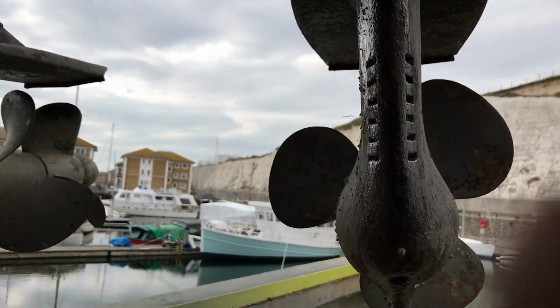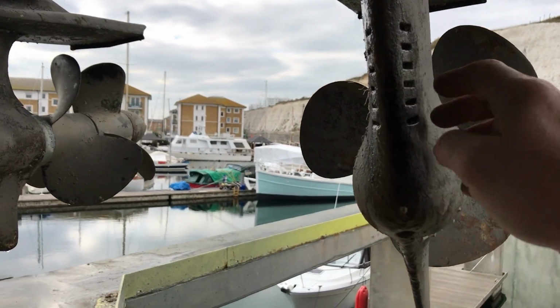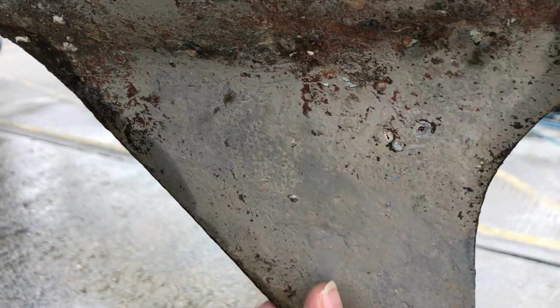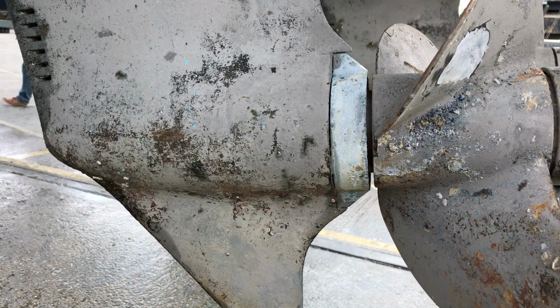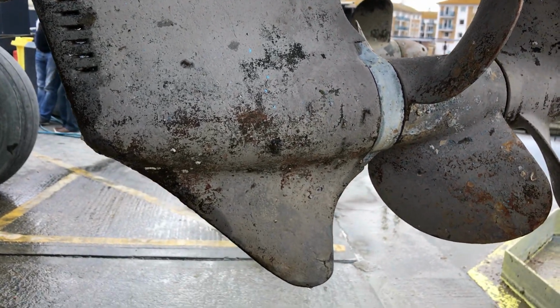And also at the bottom, if you look at the stern drive as a whole, you can see it's got a nice aerodynamic section, so fatter at the front and then thinner at the back. Also the fin at the bottom is slightly fatter at the front and thinner at the back, just like a skeg on a windsurfer or a racing yacht. And again, this just allows for nice, smooth, linear, undisturbed flow over the propellers.